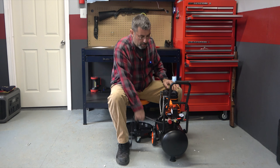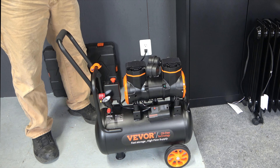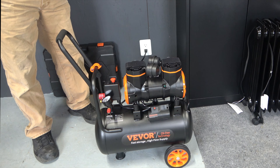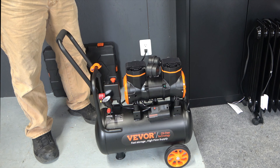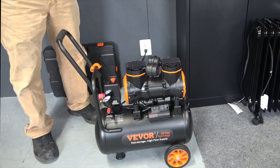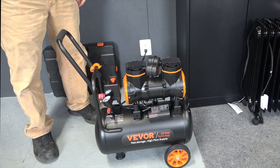I'm going to move the camera over here, fire this thing up, and let it run for a minute or two. We'll go ahead and plug it in and pull the switch and see how long it takes to pump up. I can tell you this — it's definitely quiet tech, because I was afraid this thing would make a racket. Some of these air compressors are just brutal, but I'm not having a hard time hearing or talking. We're already at 30 PSI, so the two cylinders is really helping as far as speed. It brings it all the way up to just under 120 PSI — it took right at about a minute, like 58-something seconds, from discharge to full charge.